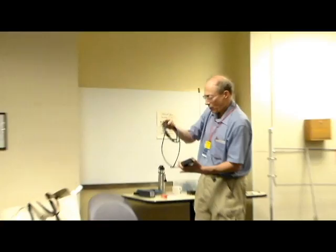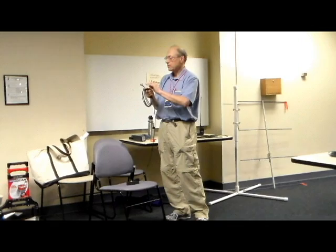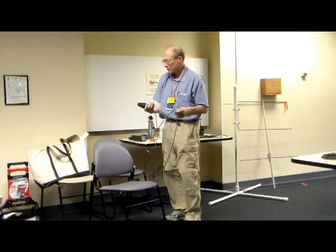And so what I've done, I got tired of fiddling with the PL-259. I finally learned that after all these decades, PL-259 is the male, and the female is called SO-239. So I replaced the connector with a BNC, and I think it's called a bayonet mount. You put it in, quarter turn, it locks. It's great, it's a great connector. So this is what I use for the car all the time. And in this area, I never use an amplifier.